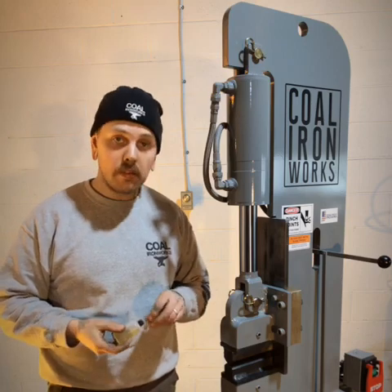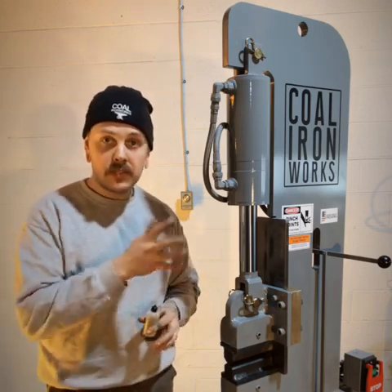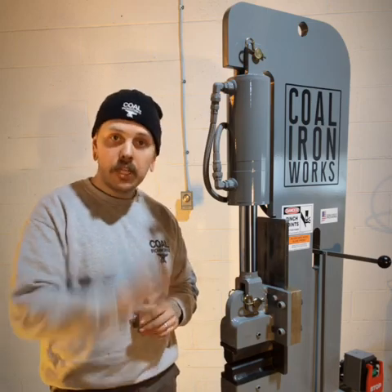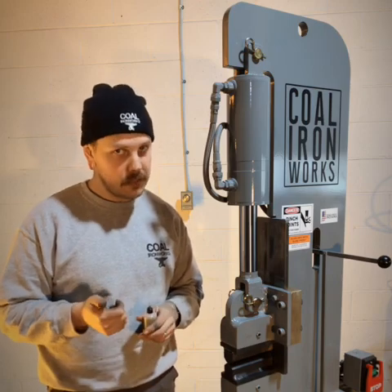I applied just a small amount of the way lube to the front, sides, and back of the slide assembly. I'm going to run the machine up and down a few times just to make sure that lube is distributed throughout the slide and keeps everything nicely lubricated.